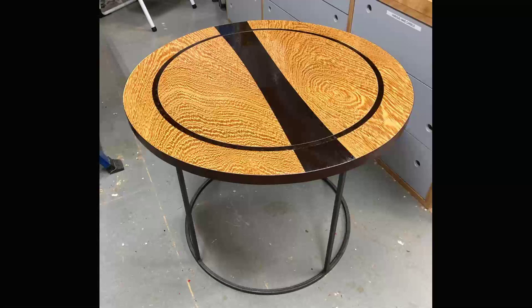Cutting the templates and curves was interesting. Then after glue up, I tried cutting a recess for the top to sit on the base. To shorten the story, tragedy struck on the second router cut. The bit came loose and went all the way through for a perfect slot to view right the way through into my outfeed table below, which is what it was sitting on. This is his outfeed table for his table saw.